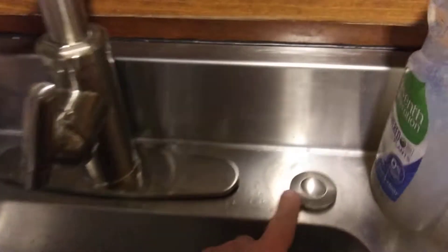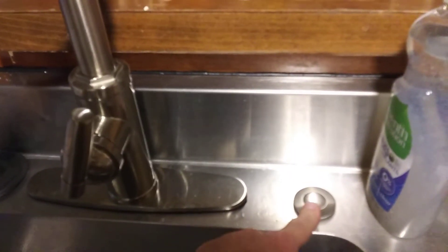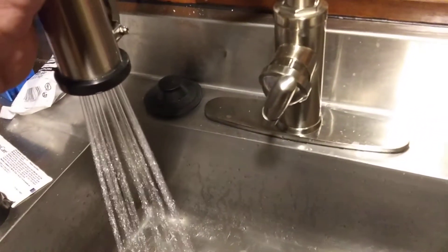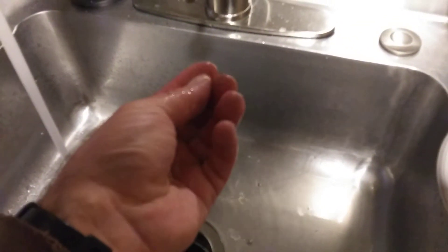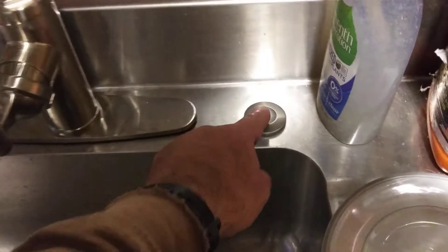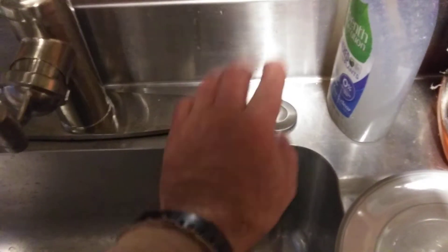There's the flush mount, and I opted for a stainless button. Without further ado — garbage disposal on, garbage disposal off. Normally you're going to be spraying food down the drain with wet hands, and you don't want to be putting your hands on even a GFCI switch. You really want no electricity near water — you don't want to be shocked or electrocuted. By pushing this button even with super wet hands, I'm not touching any electricity. It is all pneumatic.